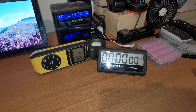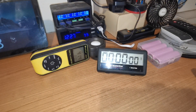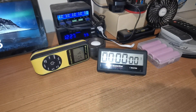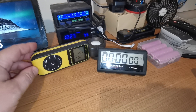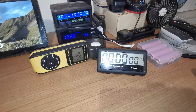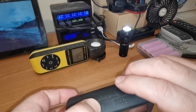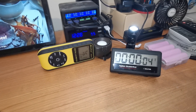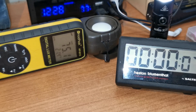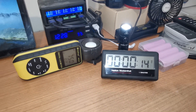What I'm going to do now with the SC21 — you can see my little timer there and the lux meter tucked in there. I'm just going to turn it on turbo and leave it going until the battery goes flat. I'm going to take note of the lux meter and get an idea of the variations in power or drops in power accordingly. I won't make you watch it all, cause it'll probably be running for about an hour, but I'll come back and let you know how it went. There we go — timer going. We've got an ambient reading of 75 on the lux meter. I'll just leave it running and keep my eye on that.